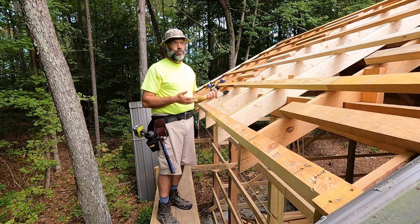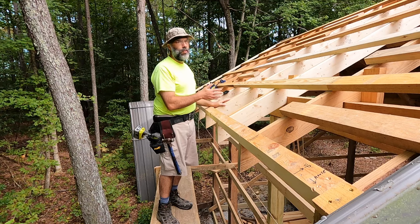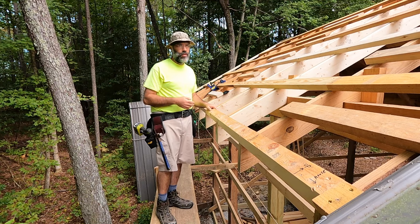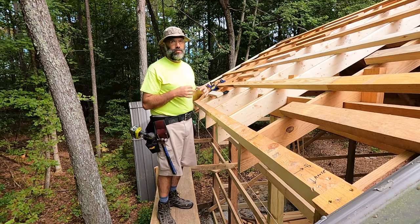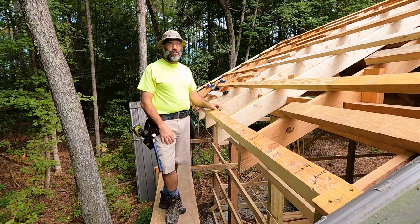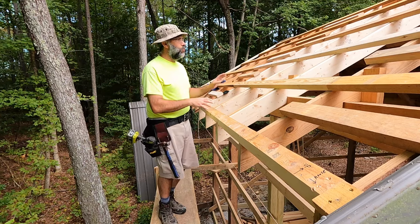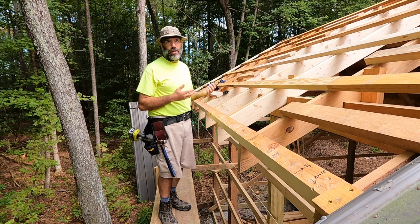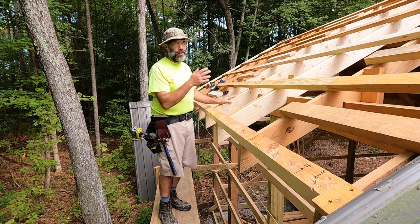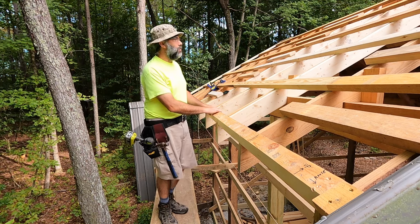This is the kind of thing that's almost out of your control. This is lumber that was straight when I sawed it, when I milled it. It was straight when I cut the rafters and put them up. But sometime in the last two and a half years, as this structure's been out here, these guys — which all came from the same log — they all went to some tendency, some internal stress, some equilibrium, which was more of the shape of a banana than a straight board. This is the kind of thing that's pretty much out of your control when you're framing with green lumber. One of the reasons I like a rafter-purlin type of framing structure with green lumber is that you're really constraining everything — you would think this is going to prevent it from moving. But there was enough internal stress, enough internal forces in these particular rafters from that log, that they curved anyways and went a little bit wild.